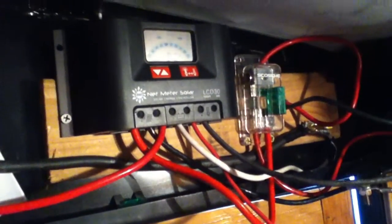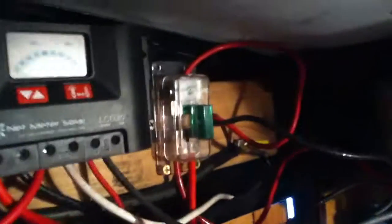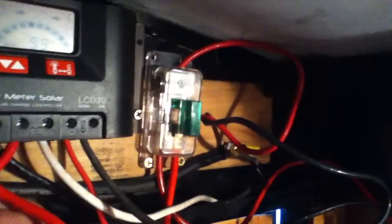The positive comes through this fuse block and goes two ways: one to this grid tie inverter so it gets raw panel voltage, which I found out it can handle. One thing I really don't like is the way these two little connectors are right next to each other — if the tails start running up on each other it's possible to arc. I'd really want to see the positive and negative on opposite sides instead of right next to each other.